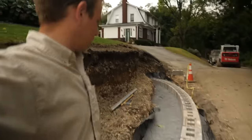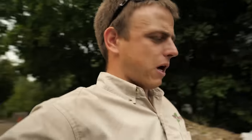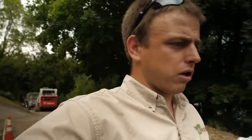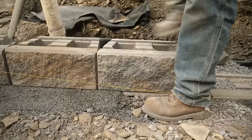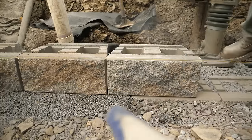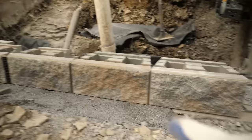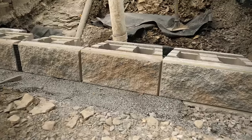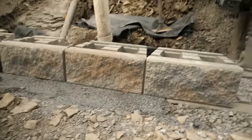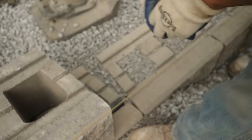That's a beautiful sight right there — we've got a beautifully flat, straight wall. So it's time to core fill this first level and then we're on to the easy part: slapping up courses of wall block and geogrid. Right there is our step — you can see the stone base, the buried course, the footer course for this wall — and then we step it up one step because we had to go over the top of the gas and sewer lines, and it's still below grade. Ben's putting in the clips, which is the structural part of bonding one course to the other.